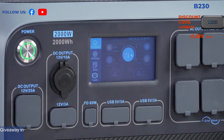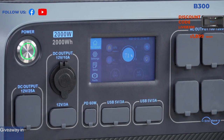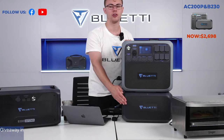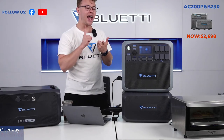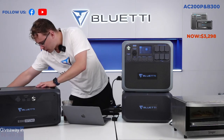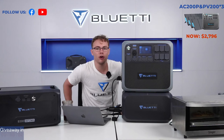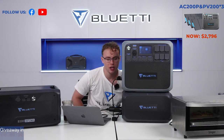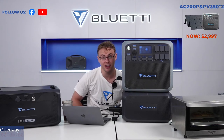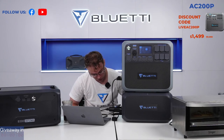Guys, right now we're talking about the input methods. Number one is AC adapter input, 500 watts maximum. This is how to recharge our B230 expansion battery. Number two is solar input, 500 watts too, under open circuit voltage. That is from 12 to 60 volts DC. These are the requirements for the input.